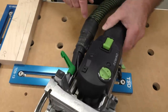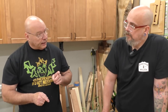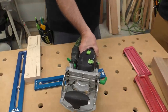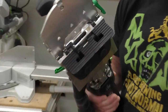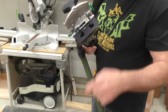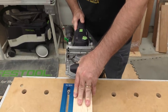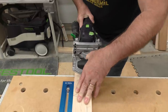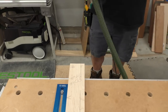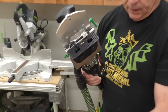I double-checked my plunge depth at 20, and this morning I checked on the machine and I got a 6 millimeter cut — that's very important. I'll do this one and then you do the next one. I get the flap down, so I'm going to reference 20 from the top, then I'm going to eyeball this one.